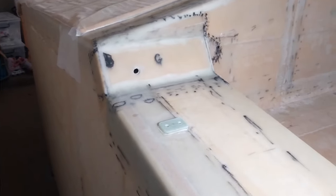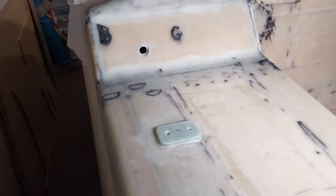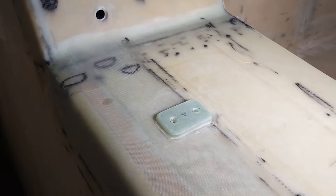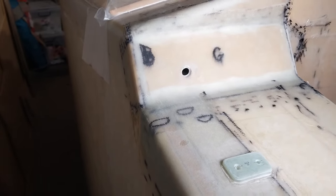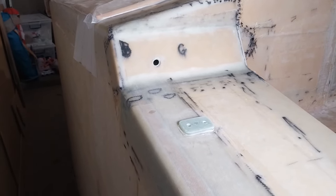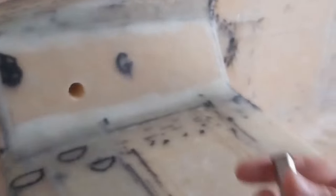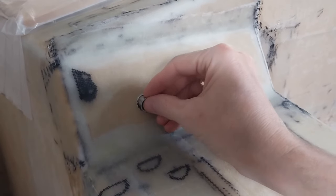Here's a quick look at the base for the bullseye fairlead I put in yesterday. That's for the main sheet that'll continue into the cabin through that little hole there. I just gave it a little light sanding, and I also very carefully sanded around the fiberglass of this opening through the bulkhead with finer and finer sandpaper to make sure there's nothing that would snag on the main sheet. That tube is a very similar diameter to the line that's going to be going through it, just slightly larger. My hope is that it keeps out most water, but I know some water could still get into the cabin through here.